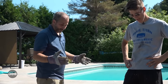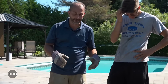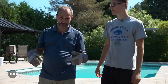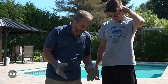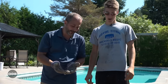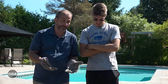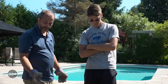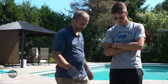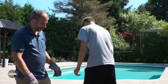In a lot of cases there'll be recommendations to put gravel in the bottom. That's fine in soil that drains, but this soil holds water. By putting gravel in the bottom, all we're doing is raising the height we're setting our fence post — we're not getting it as low as we want beneath the frost line. All gravel is gonna do here is hold the water that drains into it and become a swimming pool. There's no drainage unless that gravel continues all the way to somewhere it takes the water away. So gravel is useless here.